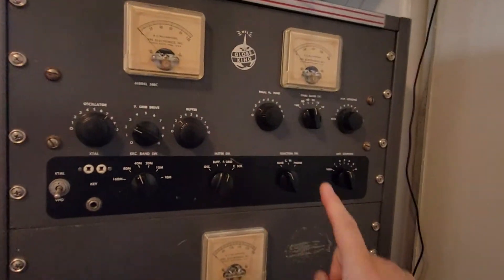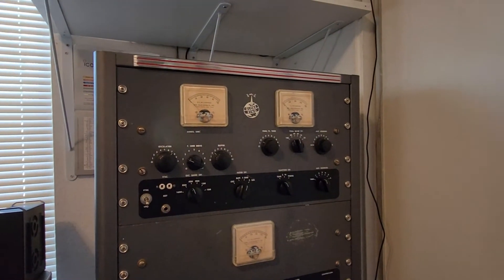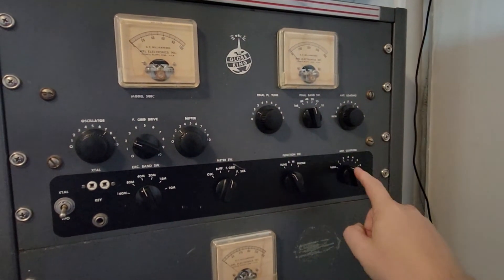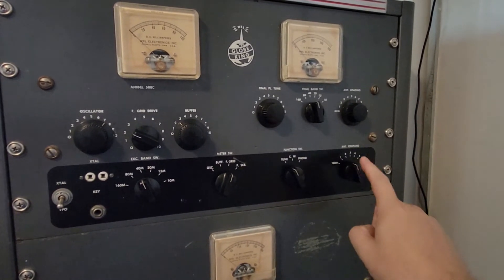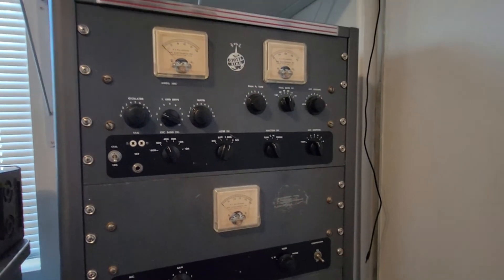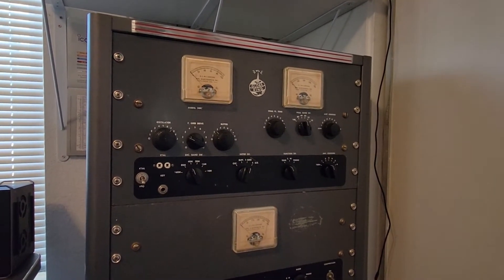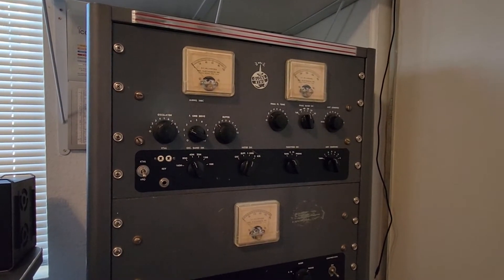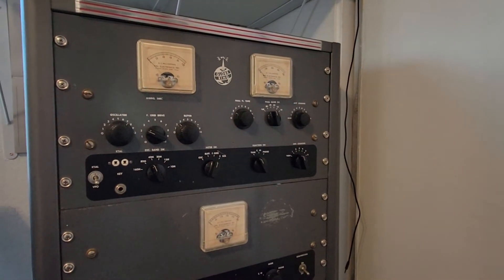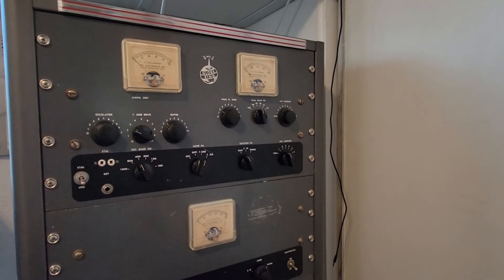It's a good idea to start out in the tune position — that's going to be lower power, less stress on the transmitter as you get it in resonance. So we've obviously preset these to 40 meters: tune in load and antenna coupling. Never turn this while it's keyed — it's switched — don't do it, you'll damage the switch in there. That's a common mistake people make on all types of transmitters — Rangers, Valiants. Return it to unkeyed or plate off, advance the control, and then key it back up. If you're using your microphone to key it, same thing: unkey the mic, adjust the control, and key it back up.